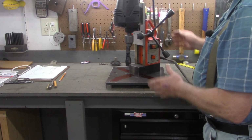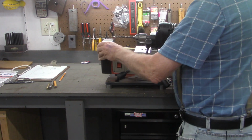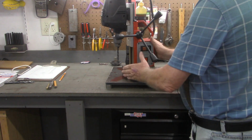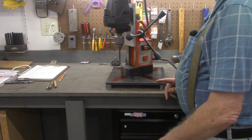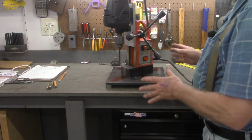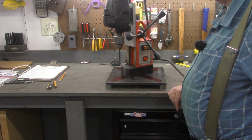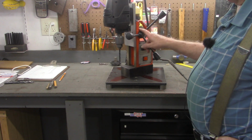Now, it's meant to be used on a vertical beam, to set it up like such, engage the magnet, and it's even meant to be used upside down. But always, always strap it down. Let's say you got it upside down and you're drilling. Now, you may take precautions and get out of the way, should it try to twist. But what if you get that bit hung up and trip a breaker? Or what if the power goes off? This thing's going to come falling down, and it's going to come falling down hard and probably totally destroy it.